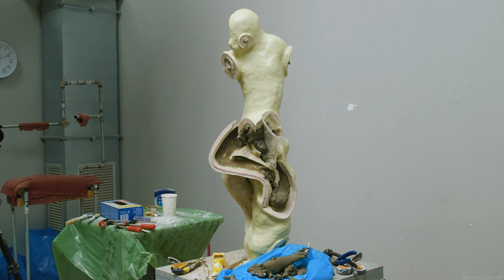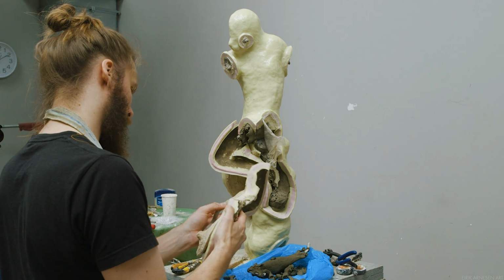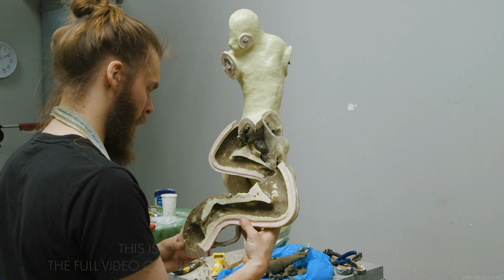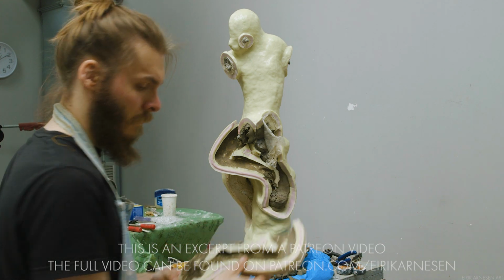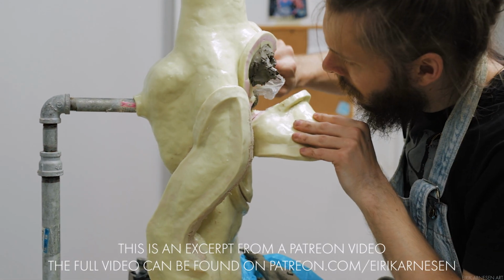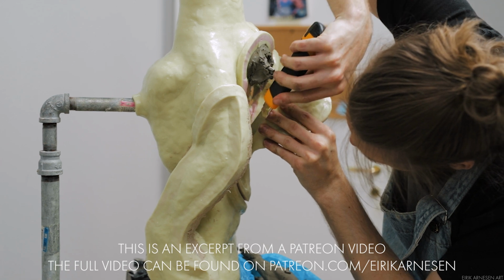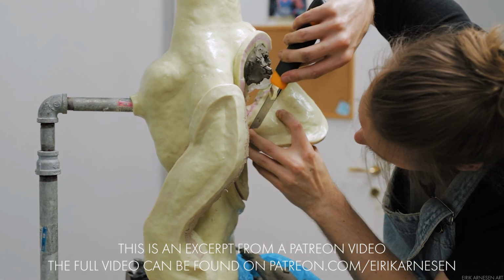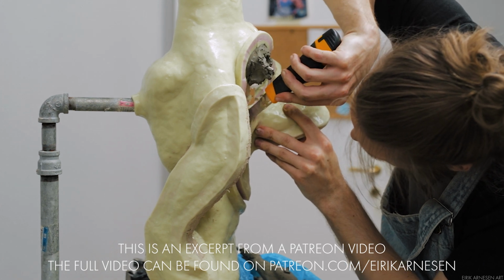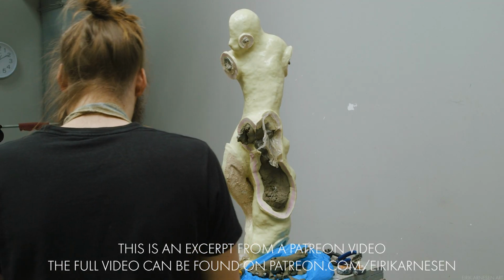Despite all our hard work and attempts, we still need to go back in with a straight blade in some spots to cut all the way through the silicone down to the surface of the clay. Some spots in the silicone skin are going to be thicker than others, so this step is pretty much inevitable. In addition to that, there are places where we will be cutting the leg pieces off from the rest of the mold. These cuts do not need to register together, and it's therefore both fine and much easier to use a straight blade.